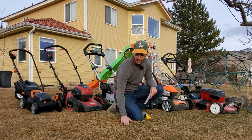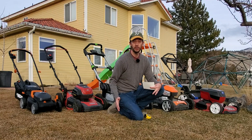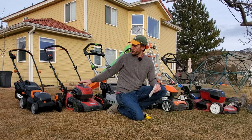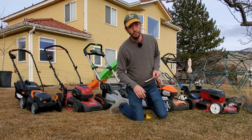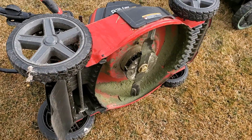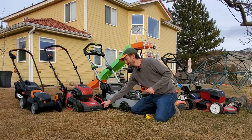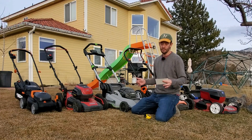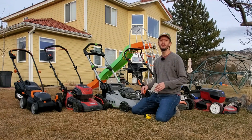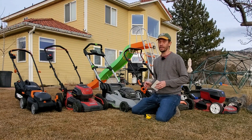It's really the tip of the blade that's cutting the grass — not the middle. The tip cuts it and then the lawnmower travels over the top. So you really care about the tip, the end of the blade. Moving up the spectrum in blade width, this Snapper 19-inch push mower has a blade width of 18 and one-eighth inches — 18.125 inches. The manual tells me the no-load RPM speed is 2,800 RPM, which is pretty common for battery-powered mowers even on the high end. Do the math — 2,800 RPMs with an 18 and one-eighth inch blade — that's going to be 152 miles per hour tip speed.